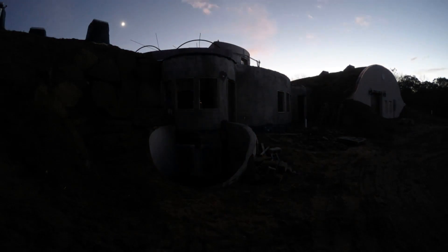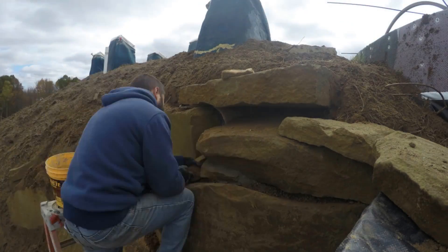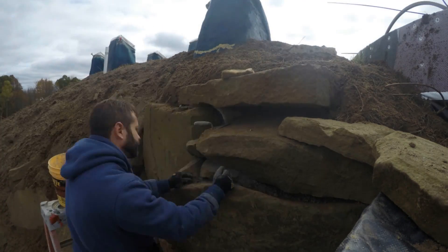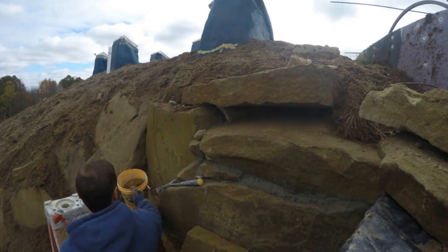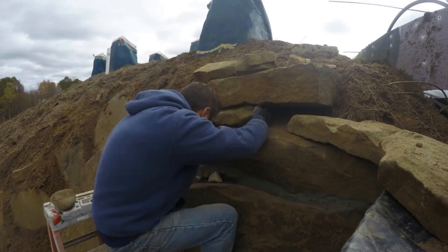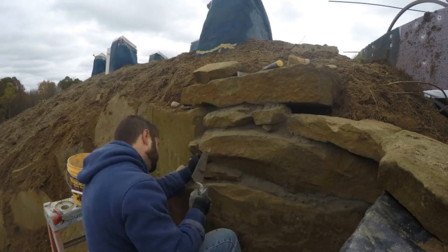I needed to add rebar pegs and mortar, and just plain old big pieces of rebar to help tie it all together. Here again, a little earlier on another evening, I was packing stones and mortar between these big boulders. We started at the top of the wall and worked our way down.